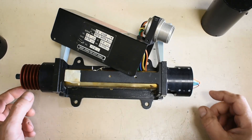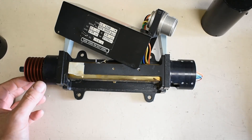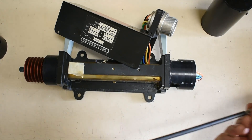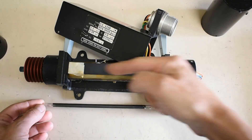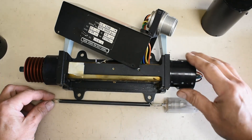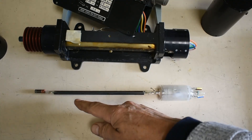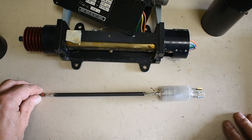Unfortunately, taking the actual electron tube out of this kind of broke it — they tend to be potted in with silicone and the likes, so it wasn't easy to remove. But basically it sits inside this tube that way. This is the electron gun assembly here, and we have a long tube here with a helix inside it, and this is the target anode at this end.